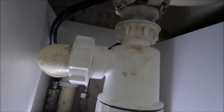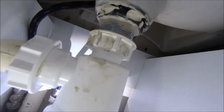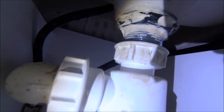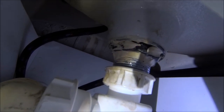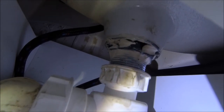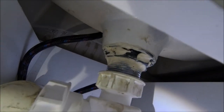Right, let me have a look. So, I stand corrected. It wasn't the pipes. The pipes have sealed. It was the waste. I've never had this before. Very bizarre, but we live and learn. Let's get some light in there. Obviously I showed you packing the top bit there with the plumber's mate, and that worked a treat. But what it was doing was finding its way through the threads, which is, again, most bizarre. So I've packed some plumber's mate around the threads now, and that sealed it up a treat. So yeah, we're good and dry now.